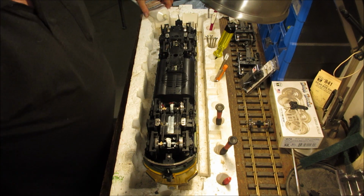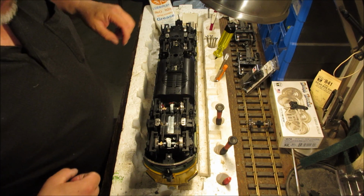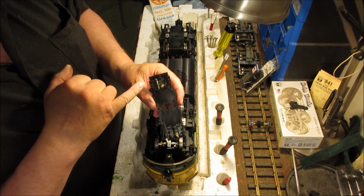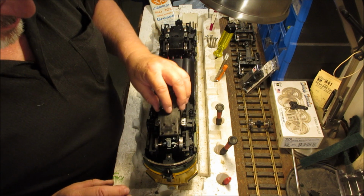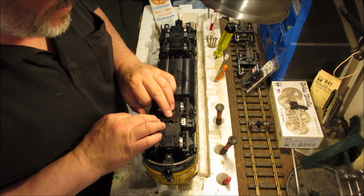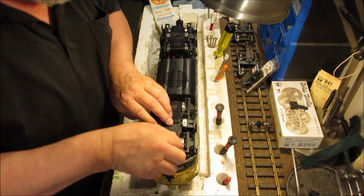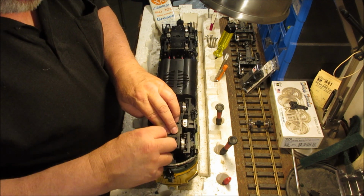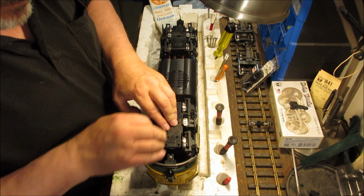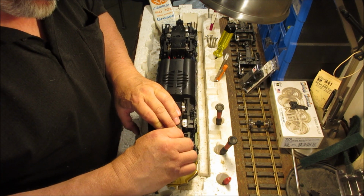And right on. Time to put the cover back on. Like I said, remember, these only go on one way. You got 4 holes at one side, 2 at the other. Make sure they're on the right side. And your sliders are moving quite freely, and the wheels are free. They've moved into the gearing. Okay, and then we'll just put all our set screws back in.